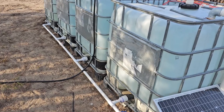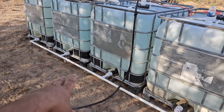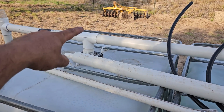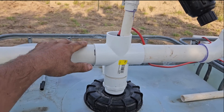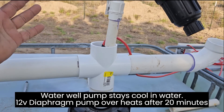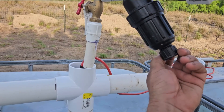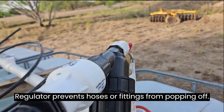Here are the tanks — these have been washed over and over for the past few months. I got them about two years ago. I have a one-inch pipe on the bottom to equalize pressure and a two-inch pipe on the top. The water goes in here, falls down into this tank, and then the pressure equalizes and fills the next one. I fed a three-quarter-inch PVC down with a threaded adapter to a 12-volt submersible water well pump, full port, and then there's a 140 or 150 micron filter. With the water off, we've got a 12 PSI, 8-gallons-per-minute rated regulator.